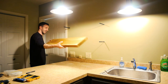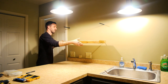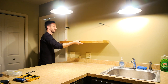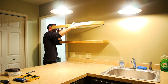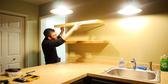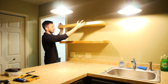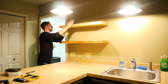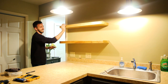The very last step is to push these shelves on. I am not using epoxy to hold mine in place — the friction from the dishes will hold this on plenty. Use a dot of epoxy on your rods if you would like, but please do not go overboard because you will never be able to get them off and you'll have to cut through the rods in the future. These are also held on by the fact that two poles will never be perfectly protruding — they can be manufactured a millimeter off, or the studs can be slightly twisted. Those poles will rub and be snug against the holes in the wood.